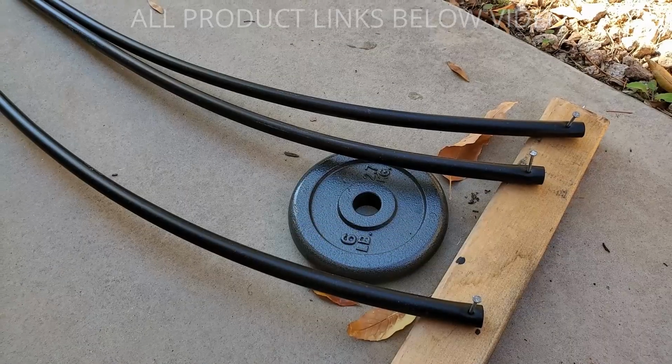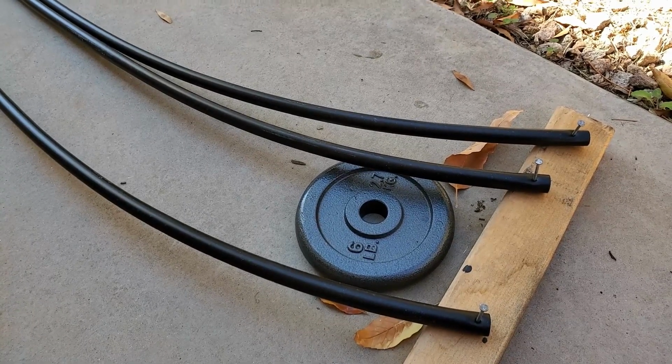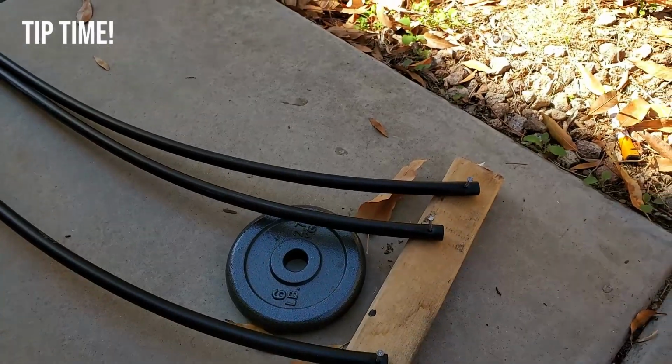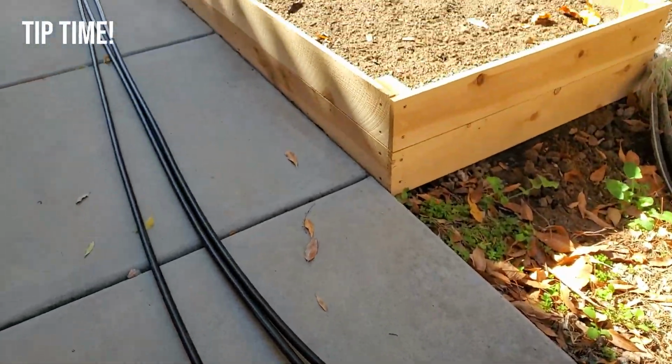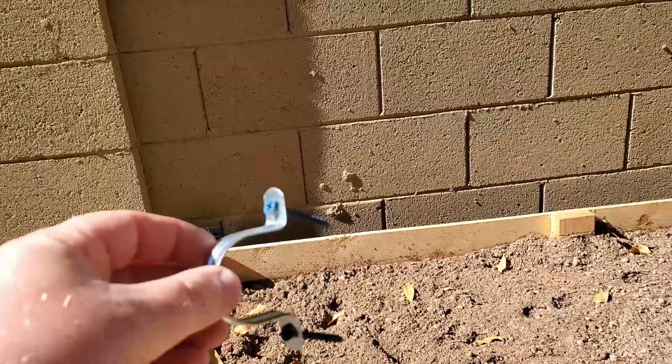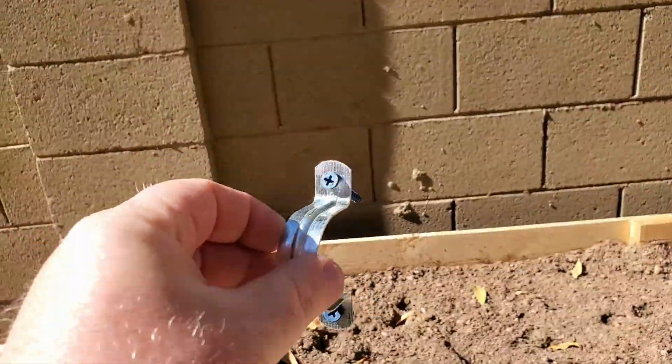We cut it into 3 lengths, nailed each end to a wood board, and let it sit out in the sun to warm up and uncoil itself so it'd be easier to work with as we hung it across the masonry wall. We decided to run the tubing along the wall to make it accessible for future changes.